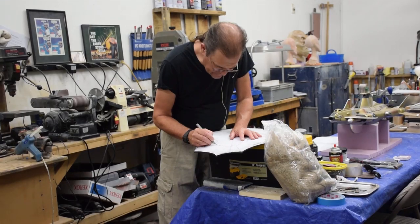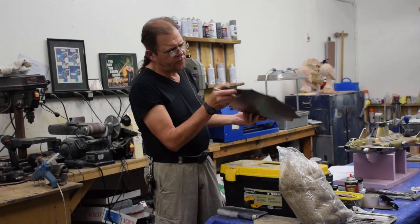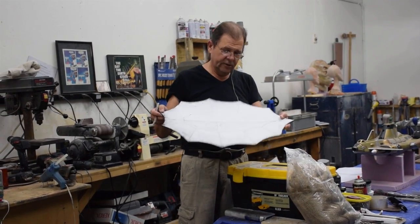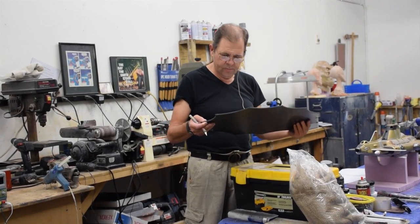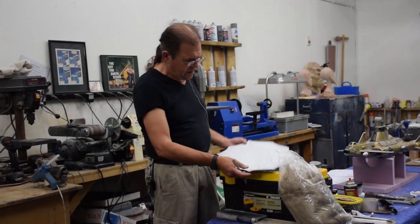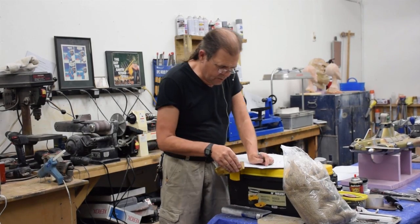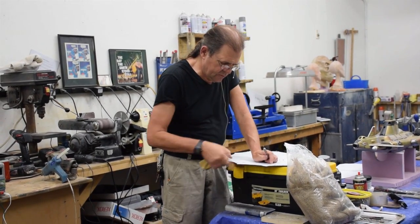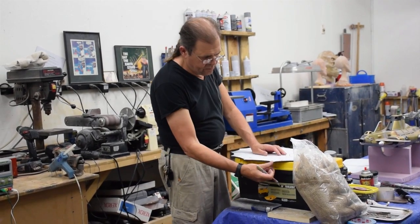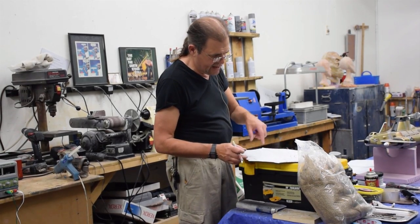What I've done is I've rubber cemented 2 pieces of thick styrene together that I got from Elliott Brown at Warm Plastics, warmplastic.com, no S. And I did rubber cement, of course, and cut these out on the bandsaw, and then after that I went around and made them nice and smooth on the sides. It's not real critical because I'm going to be laying styrene over this edge here, because there's a thickness about that much stacked between these two.